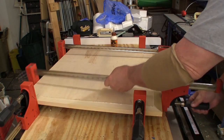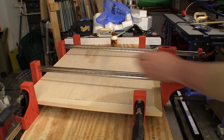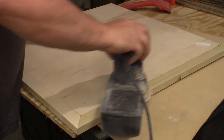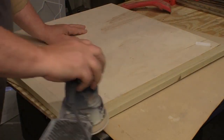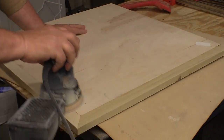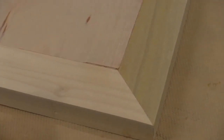This will be a corner shelf so I only had to band two sides, but banding all four sides really isn't much more difficult and you can clamp it up just as quickly. After the glue sets you can sand everything flush. If you took your time with setup and used the same thickness of wood, there'd be very little sanding to do to get it ready for finish. This assembly is made out of absolutely junk wood but with a little paint or finish it's going to look just fine.